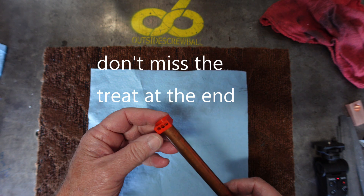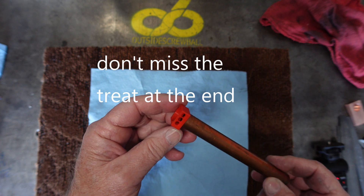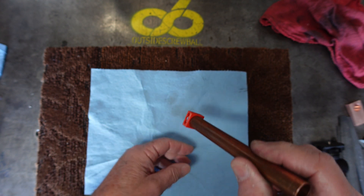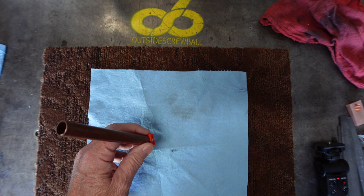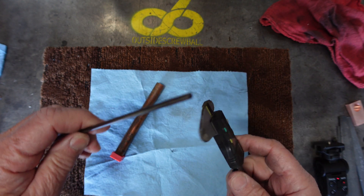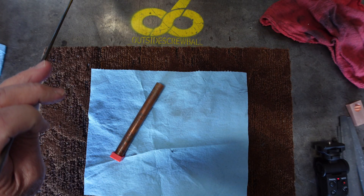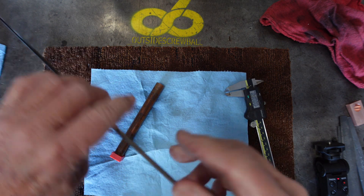For just proof of concept, I ended up printing this little block in PLA. The hole goes straight through it — three holes in there. The half-inch pipe feeds it. I have this metal tube material here; I got a bunch of it that came with a toolbox I bought. It's about a hundred-and-seventy-thousandth diameter, and I think the hole in it is about ninety thousandths.